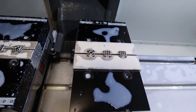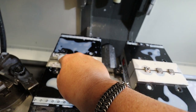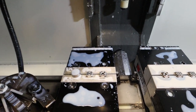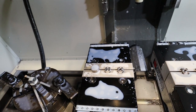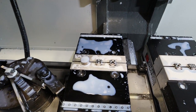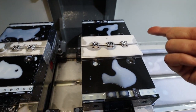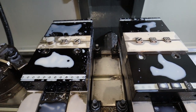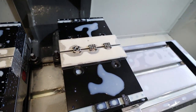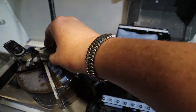This is my Swiss cube bead setup and there are six operations. This is the first op. I learned that a round part in soft jaws does not work — I'm self-taught, taught by friends. Thank you Rick, Steve, and Nick for helping me when I have questions. So that's the second op, first op, second op, third, fourth, fifth, sixth — six sides to a cube, so six operations. Each one rotates down the line, and I put the raw material in the chuck here.